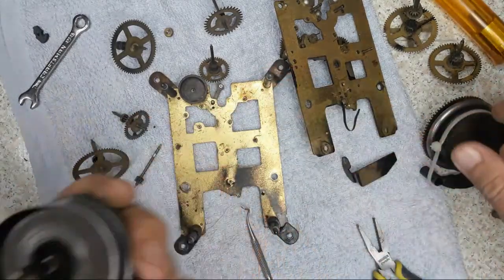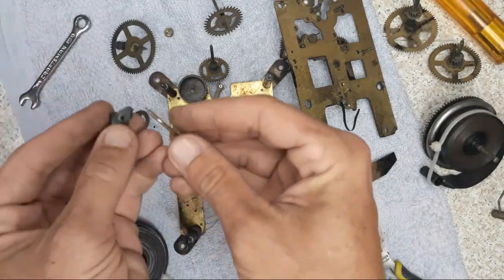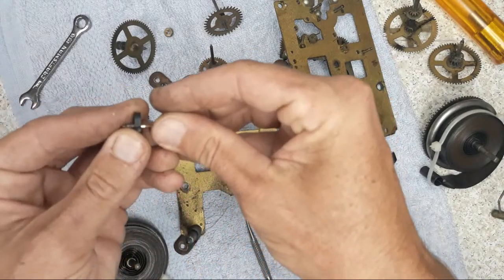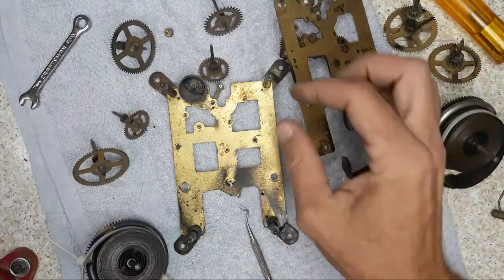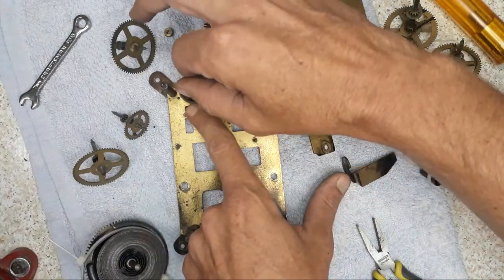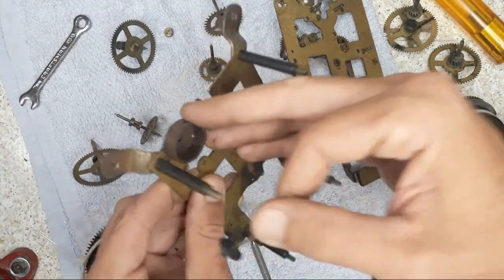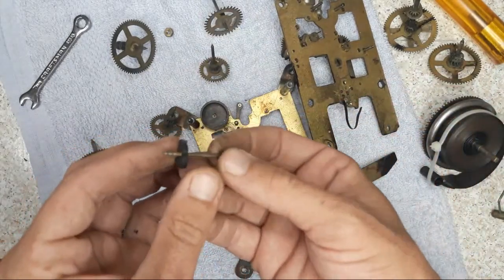And that's the goal. This is educational and really kind of helping everybody out here. This rubber disc, what used to be a disc. This is one of the reasons why they say don't work on 31-day clocks. They're just rubbish. Well, it had plastic on it. Unfortunately, this little plastic wheel is supposed to make contact with this little bowl assembly here. So when this wheel spins, the centrifugal force unloads two little weights which drag around the inside of this other plastic drum. Well, unfortunately, this plastic got old. It no longer works. It's broken.